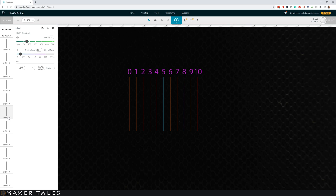Now, if you're not using a Glowforge, this will be completely different — you're going to have to look for something called a Z-offset or focal offset, which you should be able to find within your laser cutting software. The key aspect is that all of these are their own colors, as in the download, so you can set the Z-height or focus length to each one and be informed by your little test.